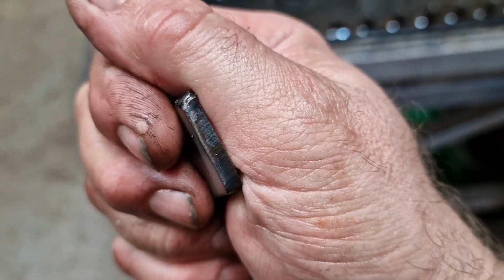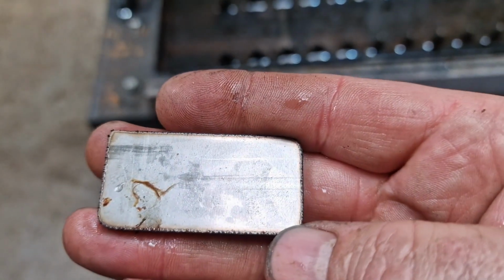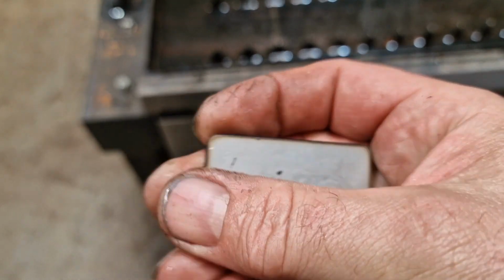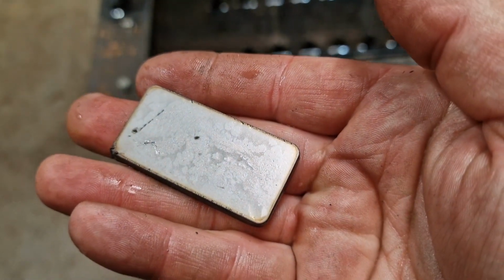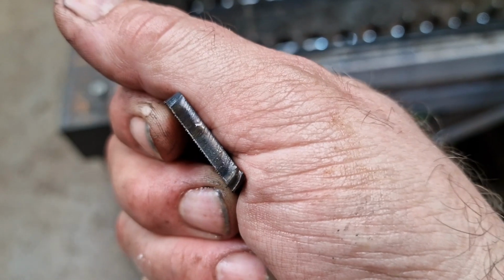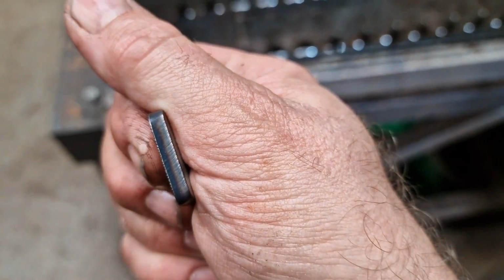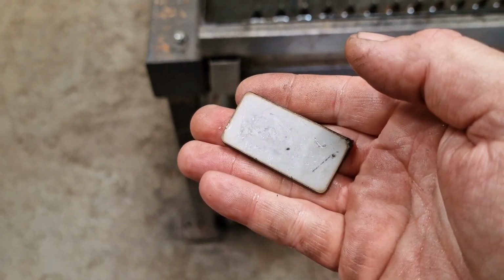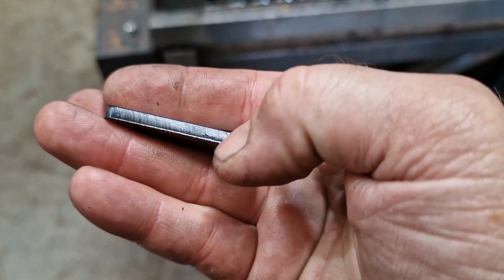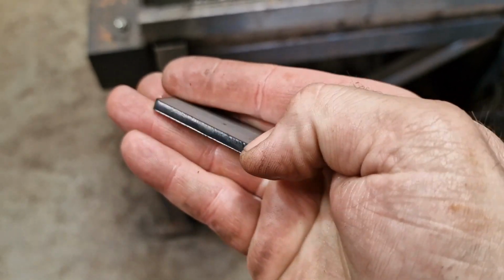So yeah, you can see, look, there's a little bit of bluing there, which is what we're looking for. Dross on the back, pretty much non-existent. Tiny little bit there, and on the front, obviously, very, very clean. I have to say, I'm quite impressed that bluing there is so nice to see. What this means really is that A, it's easier to clean up, B, it's a lot easier to weld. You could probably TIG weld right onto that, although that's going to be a video for another day. We'll have a look. It feels beautifully smooth.